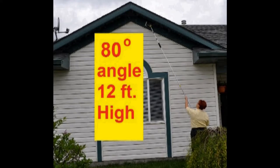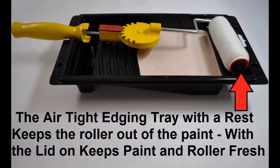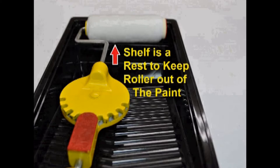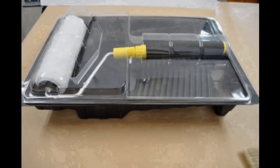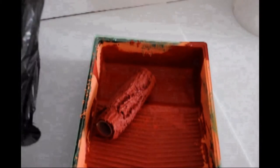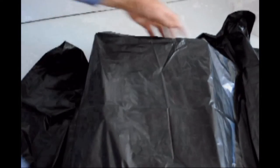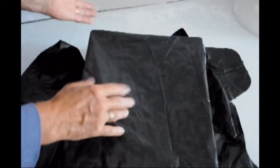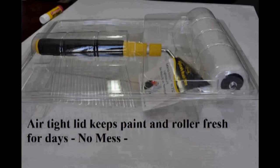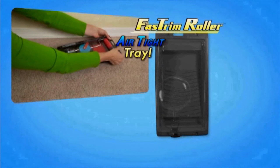Up to fascia board and soffit shown on these two rancher style homes. Our third product that helps in the overall painting process is a patented airtight tray with special features: an airtight lid and a ledge to rest the roller on, which helps keep the roller up out of the paint between usages. We have two sizes: a 5-inch tray for our trim and edging kit, and our full size 9-inch tray that can be utilized with our edging tools or with a 9-inch cage frame and roller. Everyone who has ever painted and needed to take a break has come back to find the paint has skinned over or the paint on the roller has become hardened, ruining the roller cover. The traditional method is to wrap the tray and roller in plastic or a garbage bag. With our trays, just put the roller on the rest and snap on the lid, saving time and eliminating messy plastic bags.